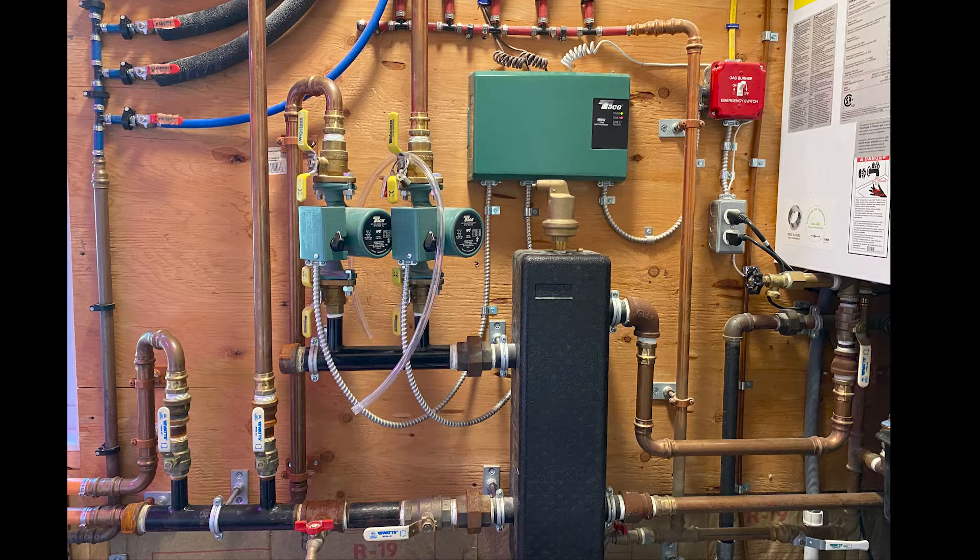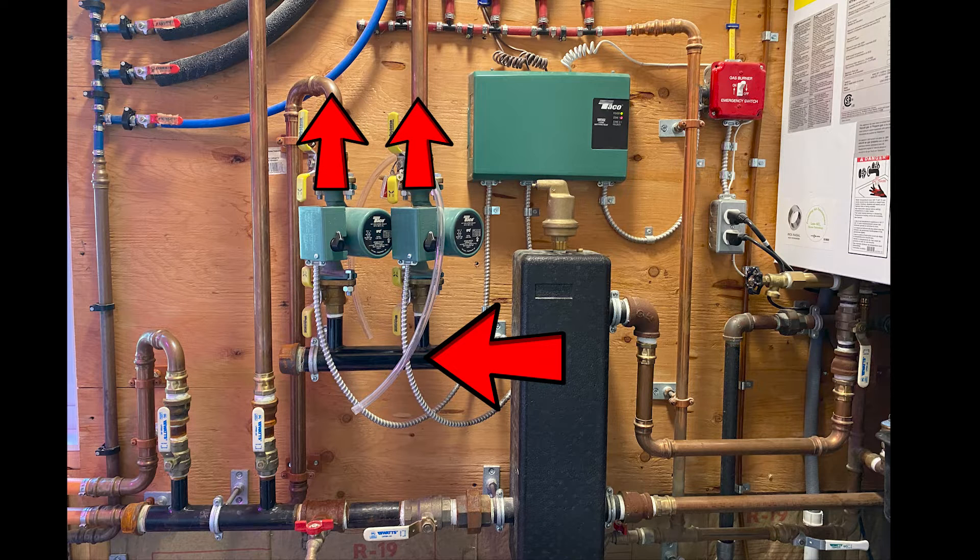In this video I give a short overview of adding a new zone in a typical circulated water heating system. This particular system is a two-zone hot water circulation system with independent circulator pumps and a propane-fired boiler. The boiler regulates the output water temperature and adjusts the flame size to account for how much heat is required. The circulators pump 105-degree water to two radiant floor headers.